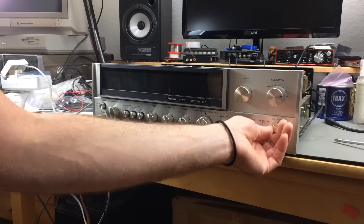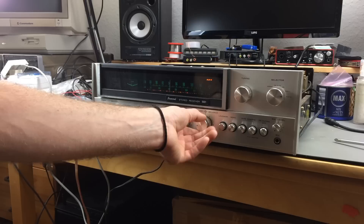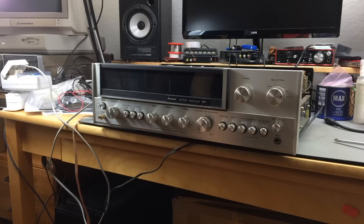It is working, so that's really cool. Maybe if I turn the mic level down, does that make anything better? No, still hums. And it's independent of the volume, so I can be pretty sure it's because of capacitors that feed the whole circuitry, not only the audio circuitry. So that's probably an indicator of leaky capacitors in the power supply section, which I'm going to replace with good Panasonic FC or FM capacitors. I think I have FC mostly in stock.